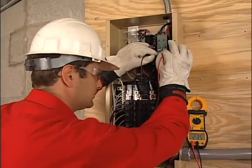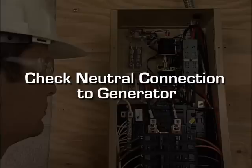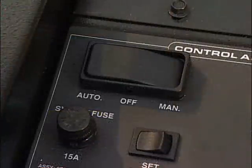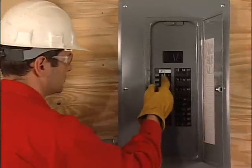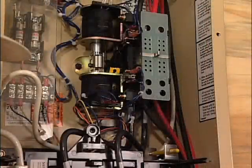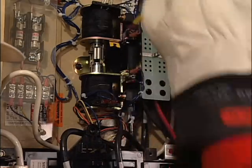If line-to-line voltage is not 240, refer to the installation guide for the proper adjustment procedure. If neutral-to-line voltage is not 120, check the neutral connection between the generator and the transfer switch. Switch the generator's main breaker off and put the mode switch in the off position to shut down the generator. Next, make sure the double-pole circuit breaker you installed in the main panel is in the off position. Use the transfer handle to move the main contacts in the transfer switch to the up or utility position.